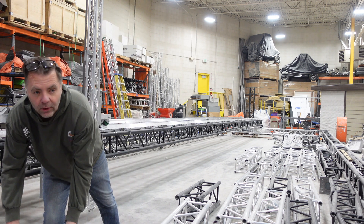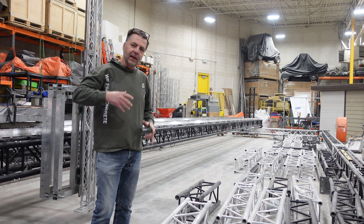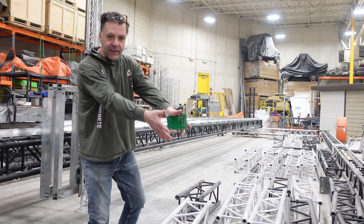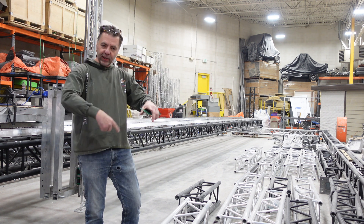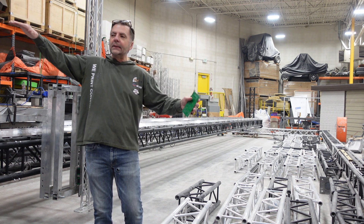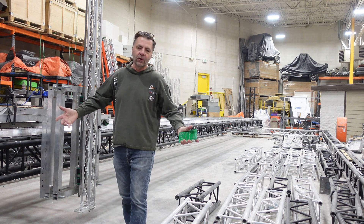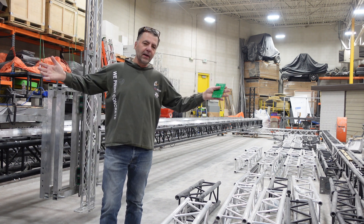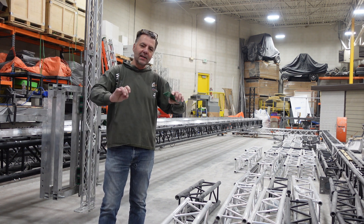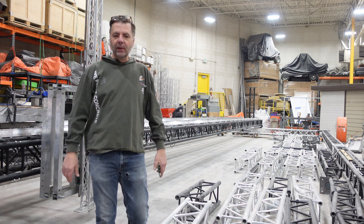We can work down here on the ground. We have elevators on each of the legs that lift this up — we put in a four-foot section, lift again, add another four-foot section, and that's how we get to our height. For a basement, we just take the legs off and it can print the basement walls. For a walk-in basement on a slope, one side would have no legs while the other side might have a four- or eight-foot piece. About 80% of lots have to be graded to drain independently, so the printer has to accommodate that configuration.